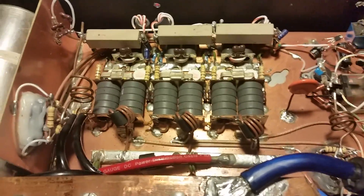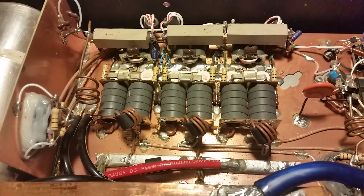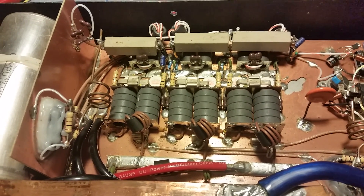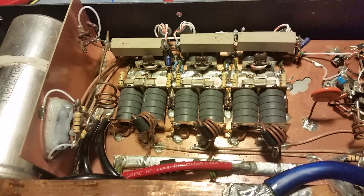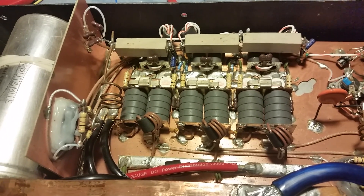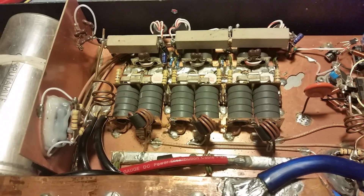The main thing you just need to remember is this is a B-biased amplifier, okay? It's gonna work best on lower voltage. I think he's running this in the mobile, so your voltage should have been fine. You want to make sure to keep your dead key down at a decent level. This thing swinging 600 watts — if you're able to keep your dead key around 150 watts or so, just let it swing, and it should do pretty well.